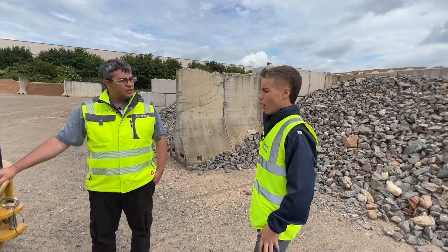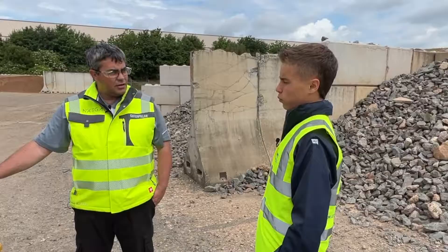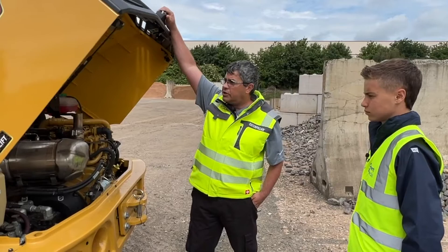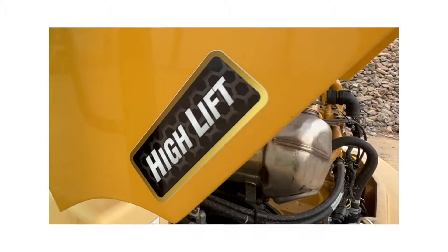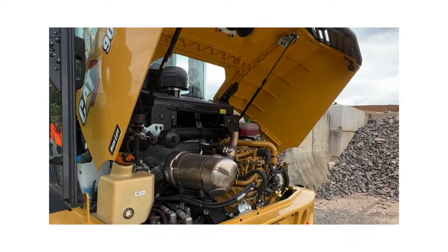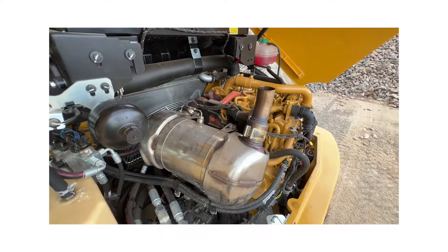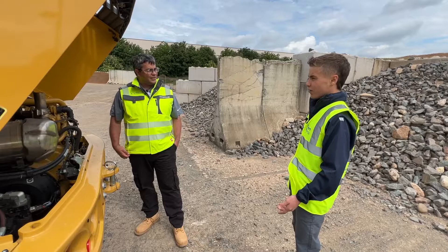From what I've heard they've added a new engine inside this 908 — would you like to tell me the differences? Absolutely. As I open this engine bay, the layout is very similar to our previous M series. But we've taken our old 3.2 litre engine and replaced it with a C2.8 Caterpillar designed and manufactured engine, which is built just down the road in Peterborough. This engine has more torque than our previous generation and we've got more controls through software, so we can do things like auto engine shutdown and we can play with the parameters to give you a more efficient ride.